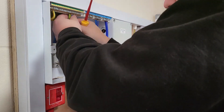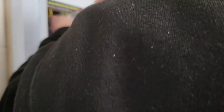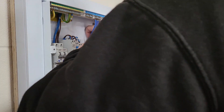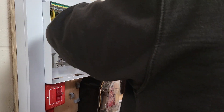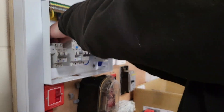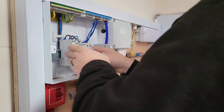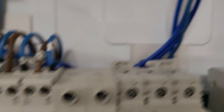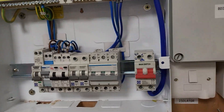Leaving cable length is important so you can pull them forward for testing and so anyone replacing the board in future has as much length as reasonably expected. These are seven-strand cables, not solid core, so they aren't quite as rigid. You can use a cable tie, but I tend to cut them off as I finish the job. I'm also using these sticky tabs that stick to the back of the enclosure with a little handle you lock over the conductors — they keep cables in place, lay them flat, and can be easily removed for future work.